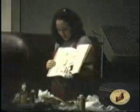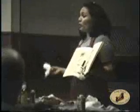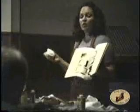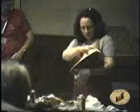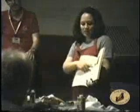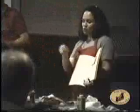Let me show you a little bit. We talk about cotton wadding, it's often called a bag or a rubber, those are the terms. You can use something called cotton waste or cotton muslin. And then afterwards you want to wrap it in a very fine cotton cloth. They're showing the shape here, and here they're filling the grain. The way you want to hold it is not in a ball shape, it's more an oval shape. This is the most important bit, because you need to get into the corners of whatever surface you're doing. So if your pad is round, you're not going to do that.